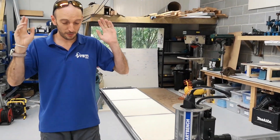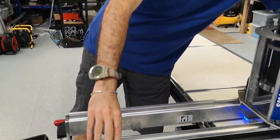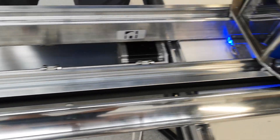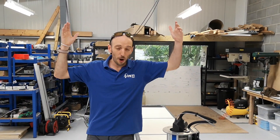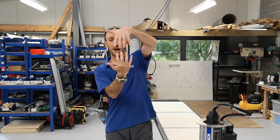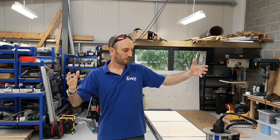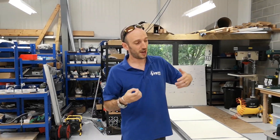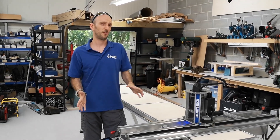Let's look at the beam — it's made up of two halves: the lower half and the upper half. On the lower half we've got a series of bearings which extend along the full four foot width of the beam, and they actually support the material. When we load the upper beam down onto that material they act as a clamp, and in doing so the whole beam can move up and down the entire length of that material. That means any position of the router spindle is entirely relative to the top surface of the material.